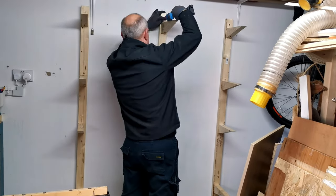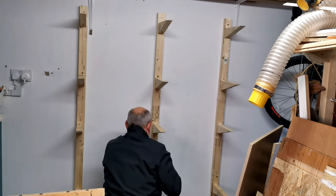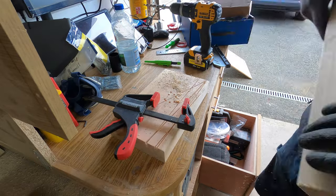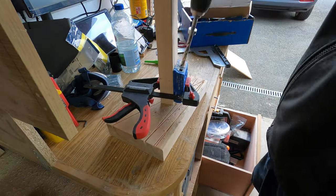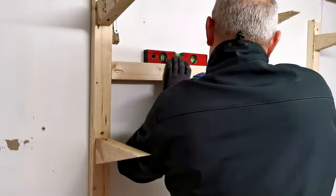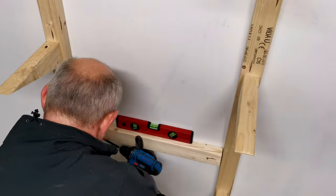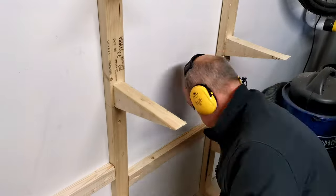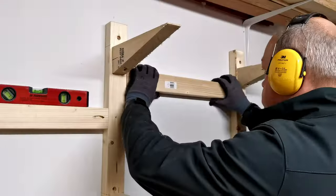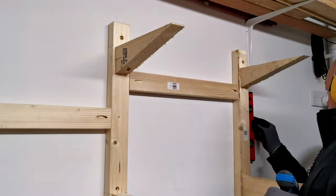The last thing was to put the brace in. Off camera I just marked exactly the middle between the inside of the two posts and put a line on the wall. At this point I felt it wasn't rigid enough, so I decided to add a couple of braces — pocket holes, here we go, wouldn't be a Garage Workshop video without pocket holes. I measured some braces, just four of them, and scattered them between the two sets of upright posts. I was really pleased I did this — it wasn't in my original plan but it just made everything feel a bit more tied together and structural.